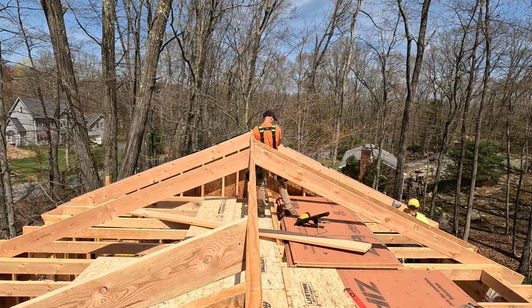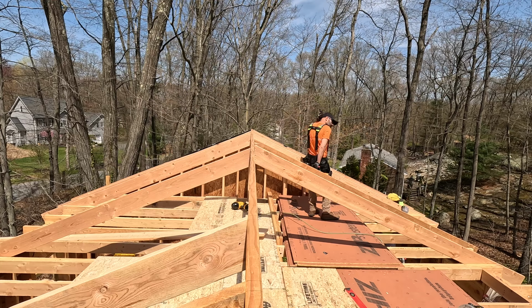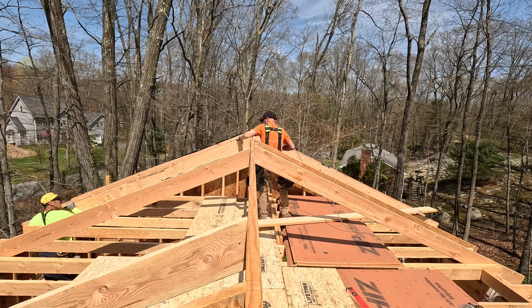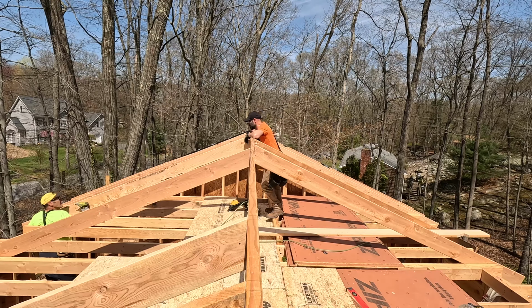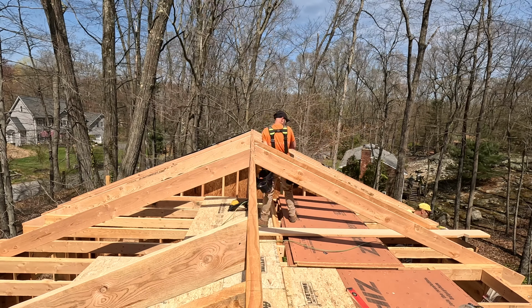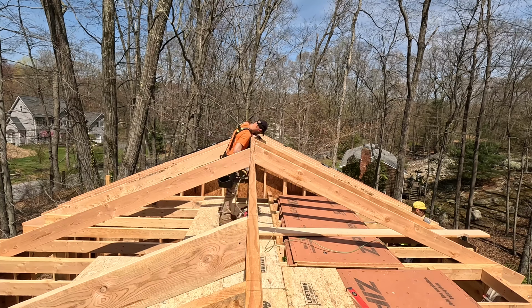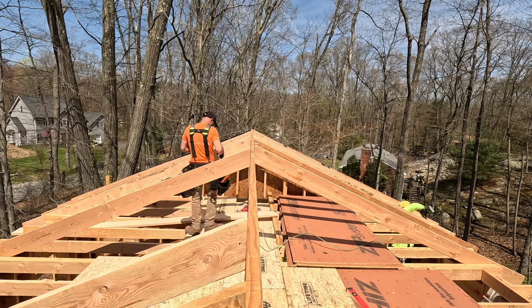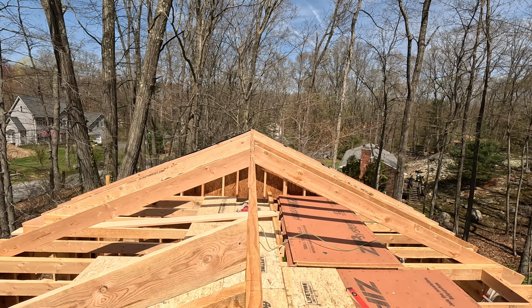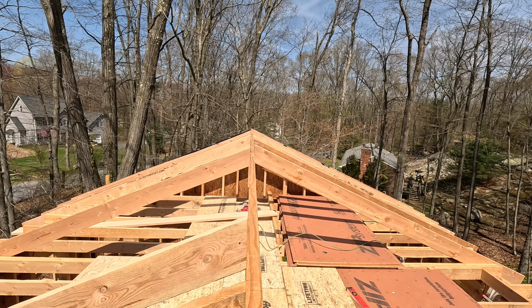And so here's a little time lapse of the rafters. One thing that we also did to try and make it a little easier on ourselves is we did the rafters on the far end. We did a certain amount of them, and you'll see that actually the roof sheathing is up on the ceiling joist. Remember I said we've kind of been moving this up, trying to make it a little easier. So after we got enough rafters up, we would put the roof sheathing on top of the rafters and hold them up temporarily. So again, we're not lifting and trying to feed sheathing through rafters, and also on the outside.